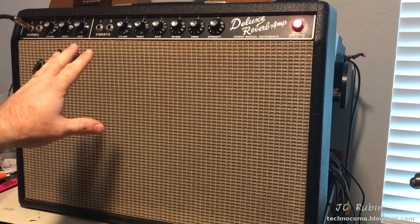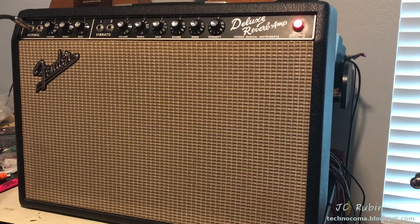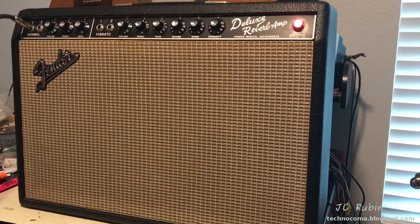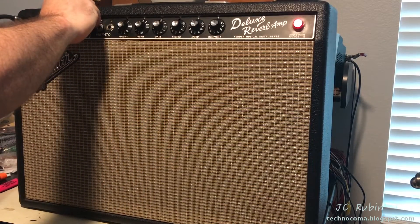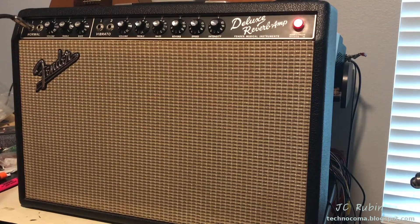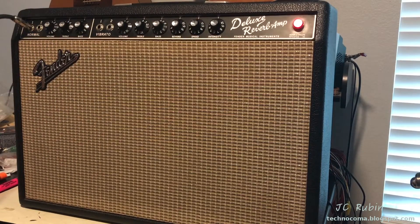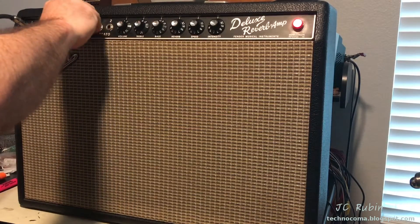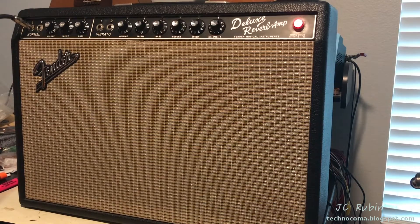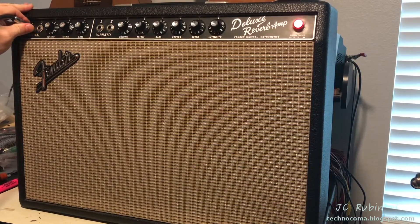It is perfectly fine in the normal position, so I'll play a G to show. We can hear that G play and everything sounds just fine. I'm going to turn bass up to nine — and now I'll drop it. Now I take the bass out, the bass is gone; put it back in — definite response there. You can hear that the problem is on the second channel.